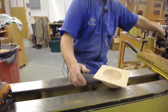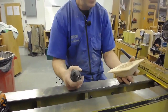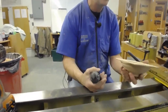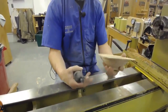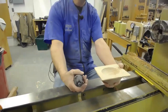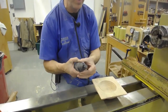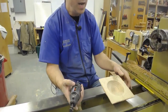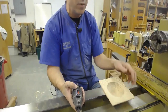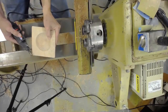I've got a piece here that's almost done with the carving. With the square-to-round bowls, I like to carve them off the lathe — I find it a little difficult to get in there otherwise. Alan used an awesome vacuum chuck carver's vise — you just turn it on, it holds it, then you reposition and turn it back on. But you don't necessarily need a carving vise. I've set it up with radial lines and concentric circles — not that I'm trying to follow the exact line, but they tell me what direction to go. It really helps with the square-to-round to head right towards the center.